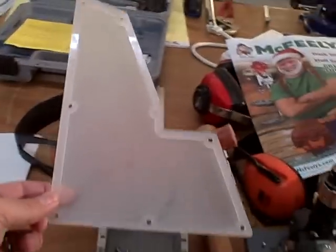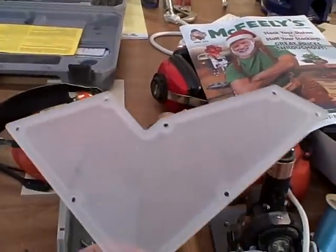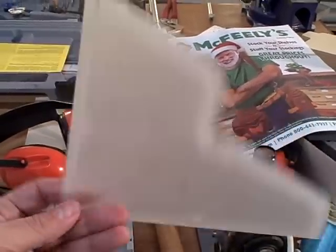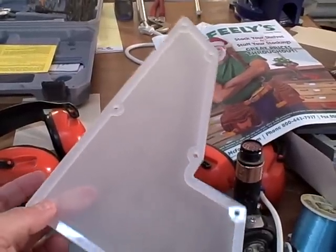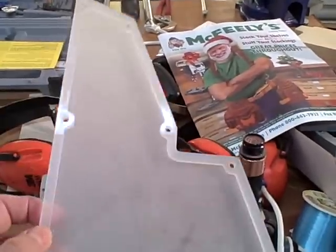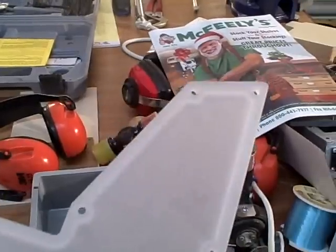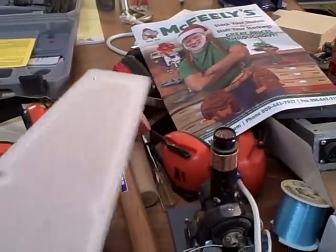The other bit of interesting stuff is this — I just made that. This is a piece of P-95 white acrylic, it's kind of white translucent. Pocketed to a depth of 0.2, leaves me about 0.5 left on it. This will be spray painted flat black on this side, and I'll mask it here so this area doesn't get any paint on it. Then it goes into the laser for final switch hole cutout and lasering. And that's all there is for today.